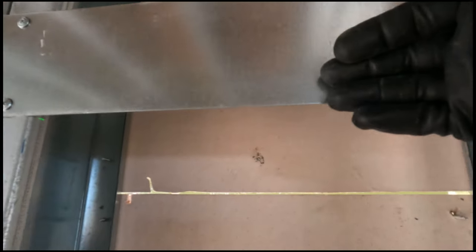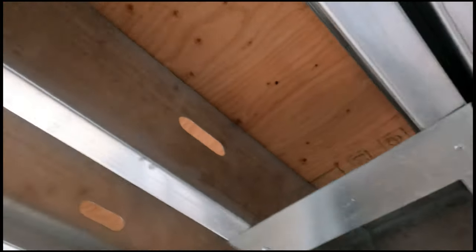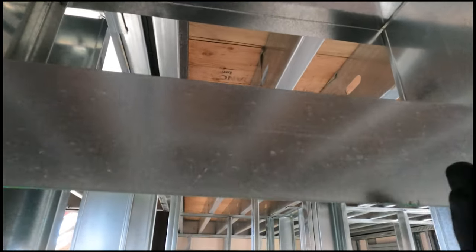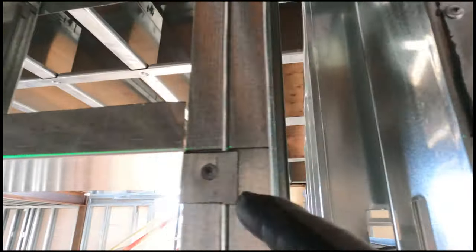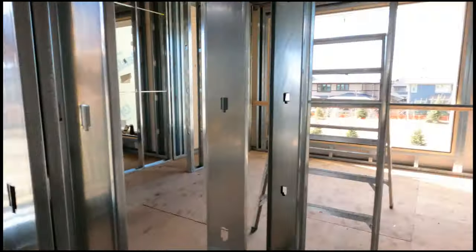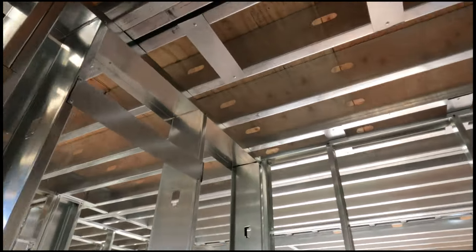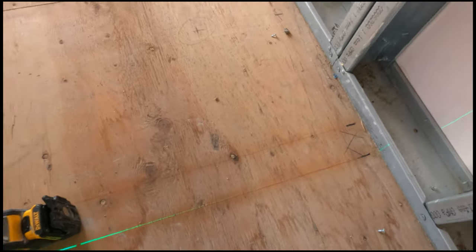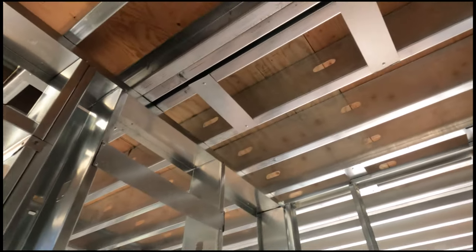So right away this is a clip-way. I'm using flat stock for the clips. What I'm showing you here is when I do flat stock clips like this, or even when I put studs inside the wall, I put them right at the elevation. You pick your high side, make a mark on both sides of the wall, put your laser on, see which mark is higher, and then you set your elevation at the high side. Do all your layout on the ground for the bulkheads and laser it up — get all your layout done on the ground first, then you can laser up.